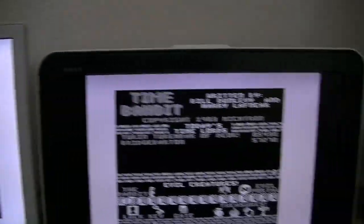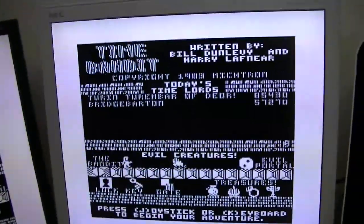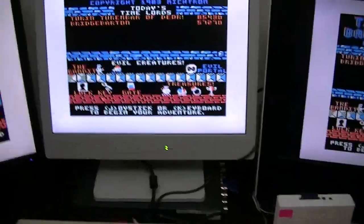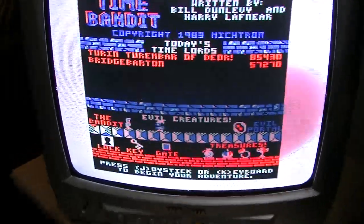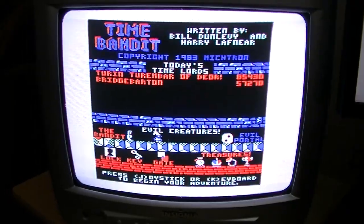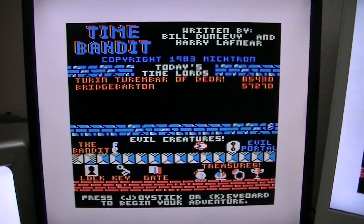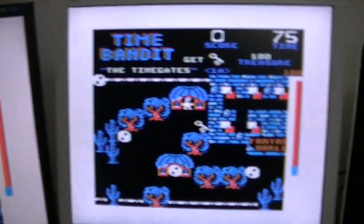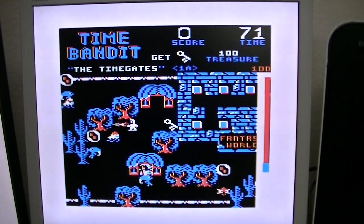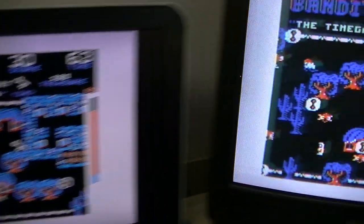But we have simulated artifacts on the Gimme-X. There's a little button on the button board that causes it to display simulated artifacts. This actually overrides the NTSC artifacts, so now this is simulated artifacts on the composite, on the VGA, on the 15kHz RGB, S-video, and the RF.